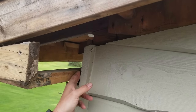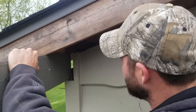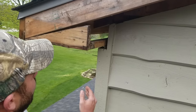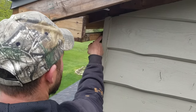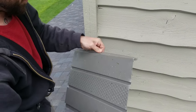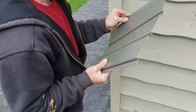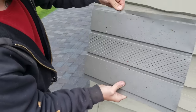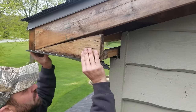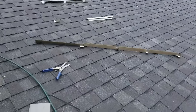The only thing we have to work around is that they have this half inch here where their soffit ran in — we're not going to have that, only this small piece of fascia. So we're actually cutting some plywood right now and we're going to run a piece of plywood back here to fill this up. That should be just enough space. I scored this first piece, you just score it and break it off. This keeps your end from flapping in the wind and holds tight down to the soffit. When this goes up, that fascia hooks right to it and sits down flush — it'll stay that way forever. I've got my plywood in, my piece on, nice and square, and I'm ready to do my bird box.